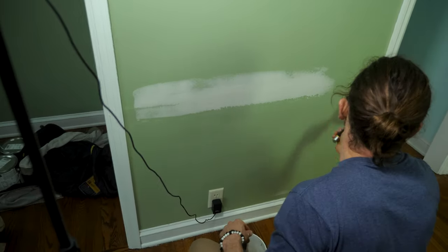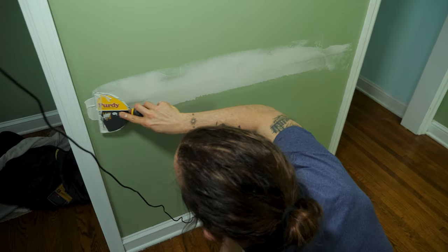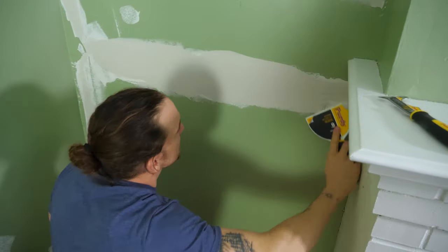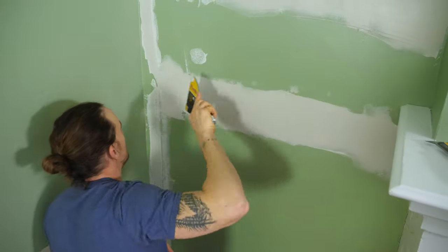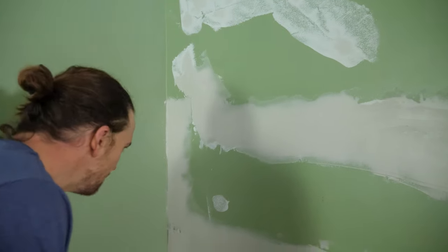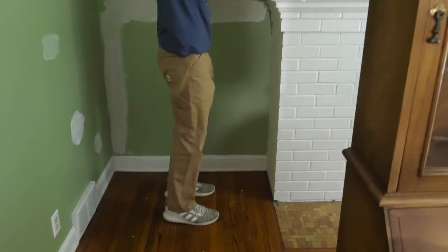I use the hammer end of the knife on holes in the wall to push the wall back in where the nail came out. It leaves a little ridge around the nail that dents it in, so when I sand, the wall sands perfectly smooth. Because I use five-minute mud, it's already set — same day I can start putting on the second coat. For small areas like these, just two coats of mud to blend them in really nicely.